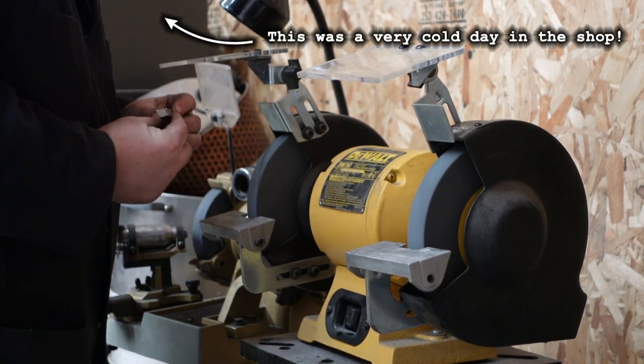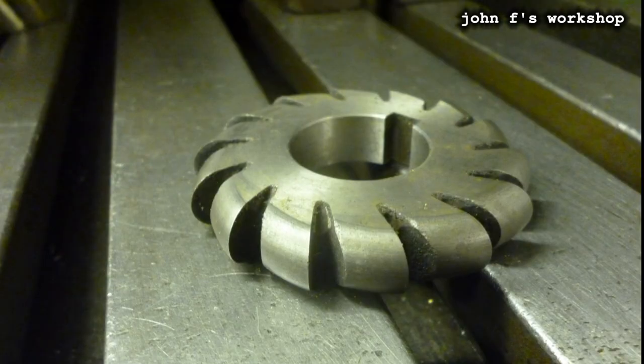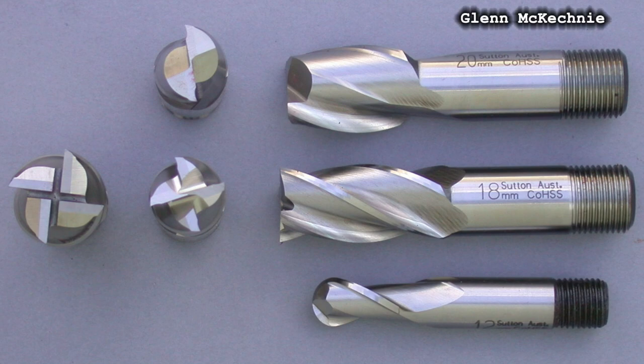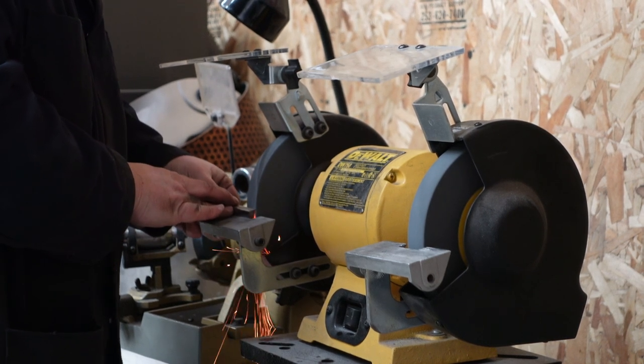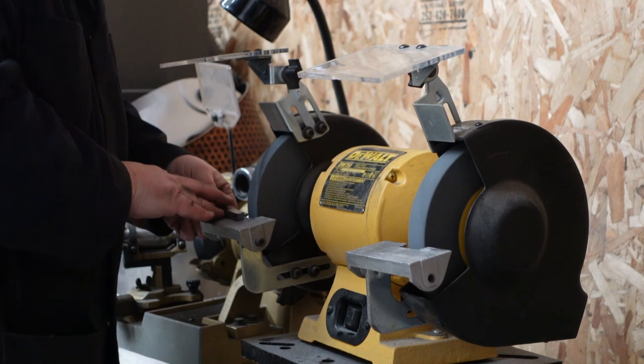You can easily make your own lathe tooling with some high-speed steel and a grinder. Same with a shaper. But mill tooling is much more complicated — even simple horizontal mill cutters have more complicated geometry, and end mills need precise helices cut, which is significantly harder still. So earlier in the industrial revolution, when material things were comparatively far more expensive, a shaper made sense. But as mass-produced tooling became cheaper and cheaper, the labor costs of running such a slow machine became more and more significant. By the middle of the 20th century, they were already becoming museum pieces. A couple are still being made, but at IMTS — one of the larger machining expos in the world — I saw a total of one shaper, and that was at a heritage display at the South Bend booth, surrounded by a small crowd of greybeards reminiscing.